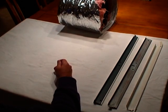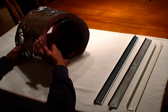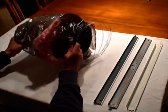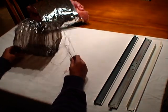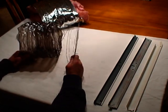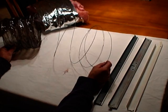Beyond our electrical wiring, another material that's being used more and more frequently in both residential and commercial settings is the flexible duct. It's comprised of the outer foil, insulation, and the inside core is the duct itself, held in place with plastic. Once all this material melts away, you're left with a big long coiled slinky. In one foot of a 6-inch diameter duct, you can have as much as 13 feet of this high tensile strength steel.